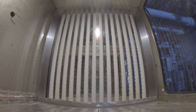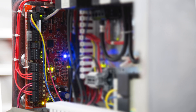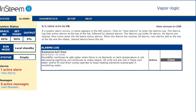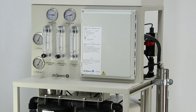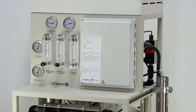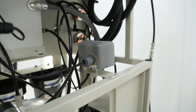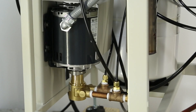The low maintenance humidification system has a combination of electronic and conventional controls. The VaporLogic controller allows the system to run while monitoring total dissolved solids in the water and demand for steam from the space. It also presents any alarms or messages generated by the system and tracks performance over time. The flow control valves, flow meter, and system pressure gauge are for fine tuning system performance. The pressure switch responds to system pressure levels by starting the RO pump when there is a demand for water and provides functional safety to the system if an overpressure condition develops.